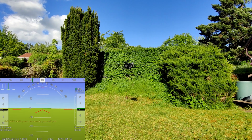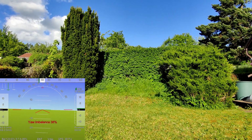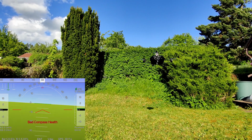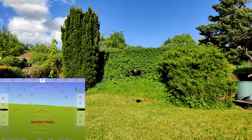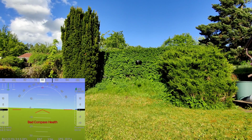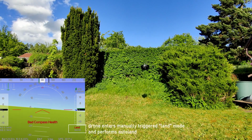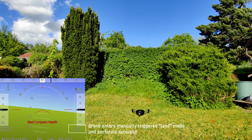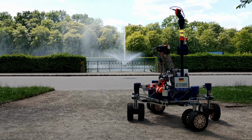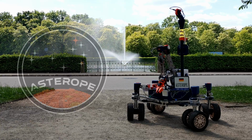To autonomously perform flights, the drone has 2 cameras and a separate compute unit to perform image recognition and flight path planning. This not only increases overall performance, but running all safety-critical flight stability computations on a dedicated controller also gives us safety through redundancy. With this architecture, we are confident that we will be competitive but safe and have a flexible platform to build on in the future.